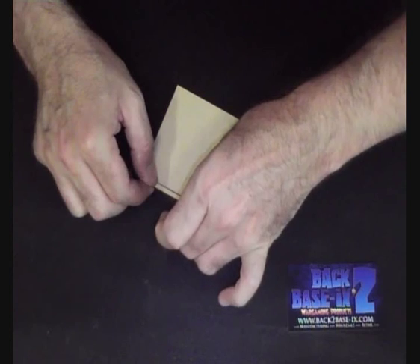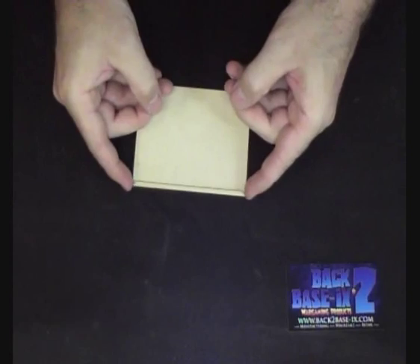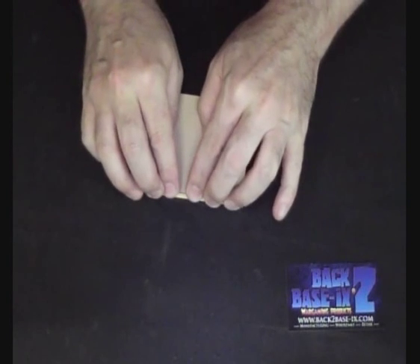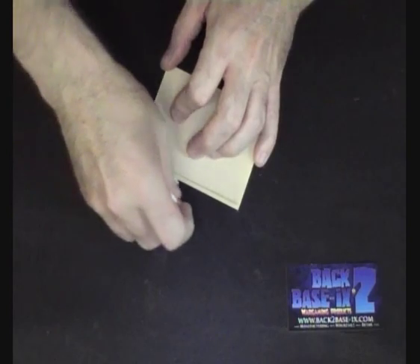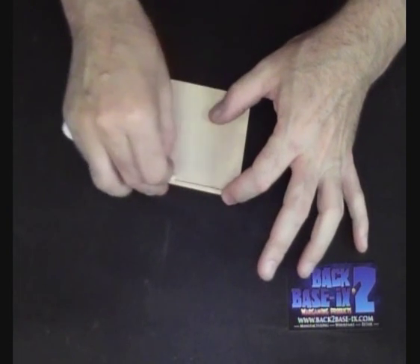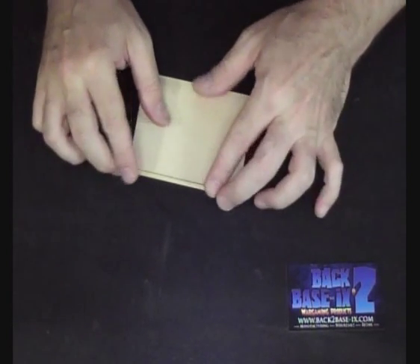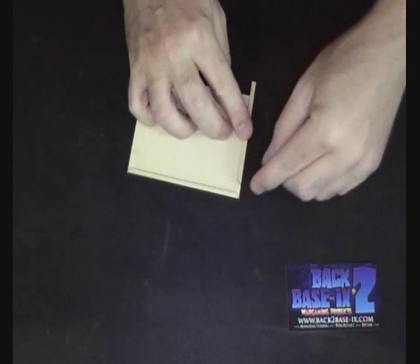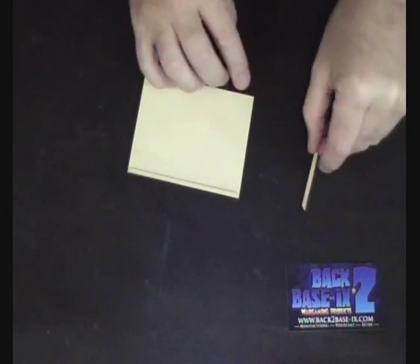Just make sure that front lip is nice and flush. Check your mitered corners and make sure they're on the extreme outside corners of the tray. The glue is actually starting to dry already, which is pretty good. If your glue is taking a while to dry, just set it aside and move on to your next tray and come back to it. Now I'm going to put on one side — look for a mitered joint at the front that pulls up nice and tight, flush on the outside and at the back, no overhang and no undercut.